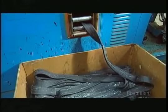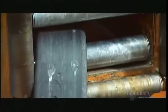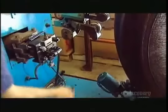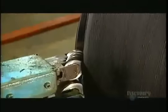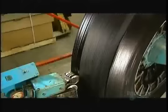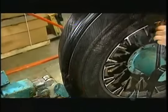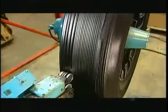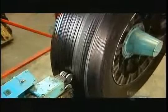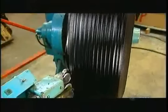Workers can now start rebuilding the tire. They feed a rubber strip into a machine called an extruder, which first heats up the strip, making it malleable, then wraps it onto the casing, building up anywhere from two to four layers depending on how thick the customer wants the tire to be. That depends on several factors — for instance, how much traction the tire needs and whether the truck will be doing mostly local or long-distance driving.